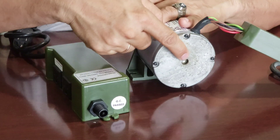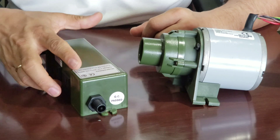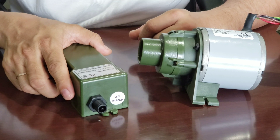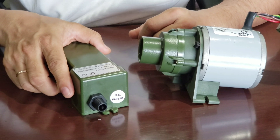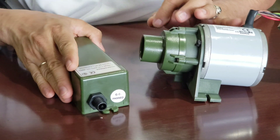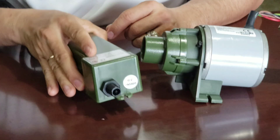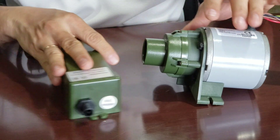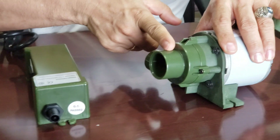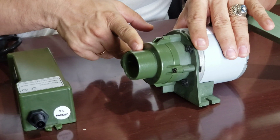This explains why the pump makes noise — either water gets into the bearing, or the seal gets damaged from running dry. I hope this video helps. Salon owners and spa dealers: please do not use a cheap power control box. Do not combine the drain pump and the jet in one box. You must have a separate air button to activate the drain pump with a time delay — the drain pump must have a time delay. Thank you.